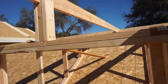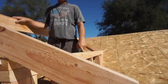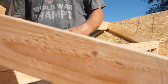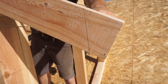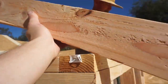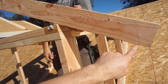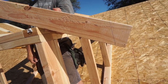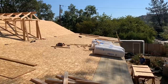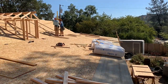Now it's time to get one of these rafters. This is 6-in-12, close enough. It's 105 degrees today — we should get out of this heat. Here's our finish line: our overhang from there to there is 13 and a half inches, so we've got a foot overhang plus the fascia board which is an inch and a half wide. That's about what it's gonna look like. To prevent my dad from actually dying of heat stroke, he decided to come back another day when it was a little bit cooler.